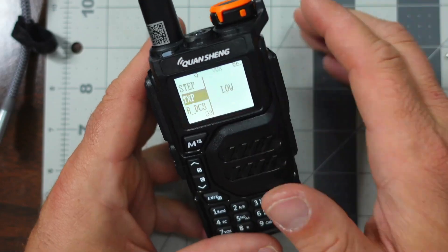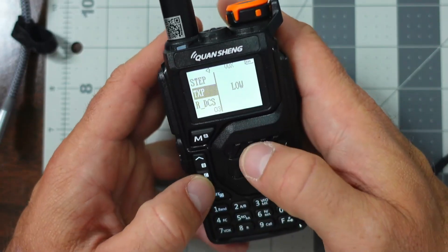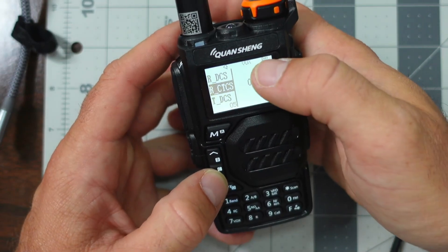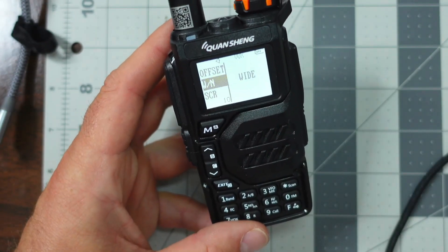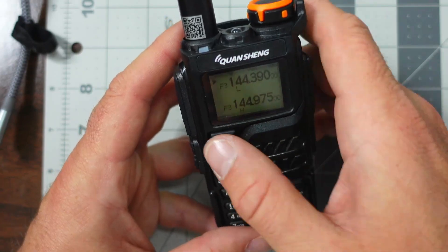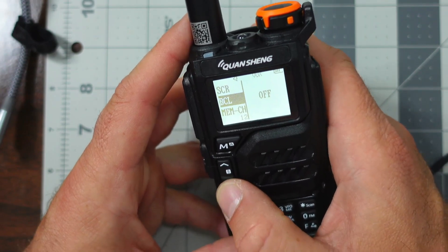As we page down, I have my TX power set to low today because I'm testing in-house and I don't want to transmit out super far, especially if I'm testing and sending APRS over and over again. Then we go to the CTCSS settings — they're all off, that's fine. Here we have wide and narrow. Initially I had this set to narrow, but MI7DJT explained that in the European or UK standard it's narrowband for APRS, and allegedly it's wideband for the US standard, which I'm going to do some reading on to further educate myself.